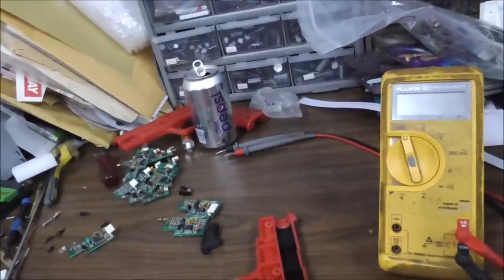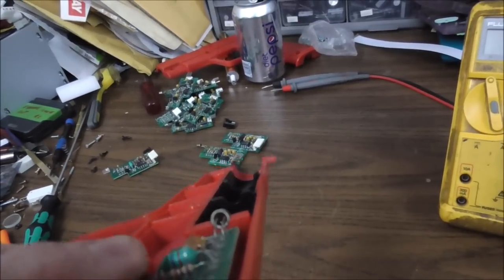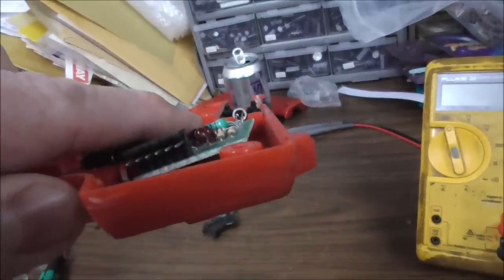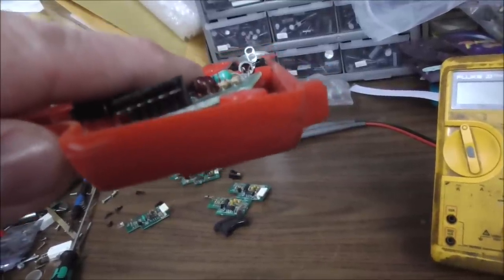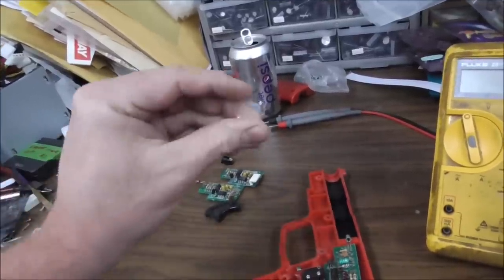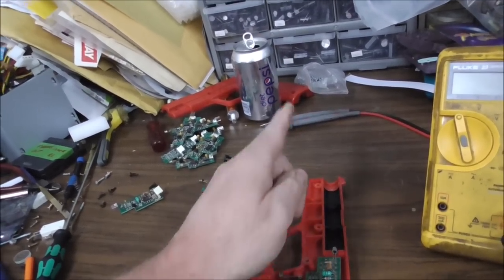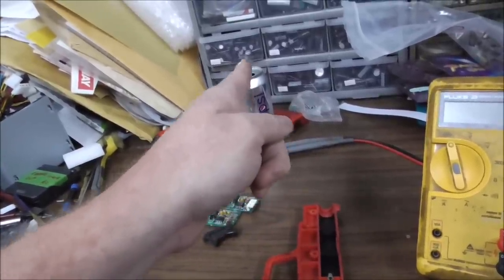And what's more is you've got it holed up inside this little shaft, and you're aiming that at the Pepsi can. So all it can see is the little tiny thing you're aiming at, right? Like the pull tab on the Pepsi can. See how that's about all it can see through the end? And then it has a lens on the end to make it even more dramatic, right? So you're just aiming at a specific little part of the screen, and that's all that photo transistor can see, right? It can just see that little area of the screen right there.